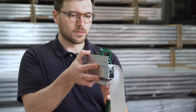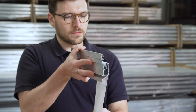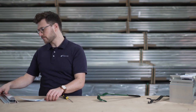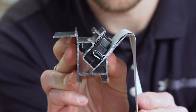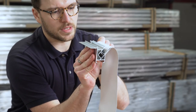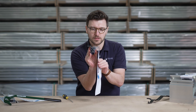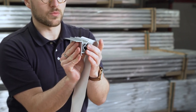You twist to create more tension in the clip. Again, with the way that the clip works, the more tension you create, it doesn't matter — the clip is not coming out. Here's our retro frame with a clip already in there. And as you can see, when the vinyl gets pulled, the clip is being twisted and the teeth engage with the teeth in the channel even more. So that's why we haven't had a single failure in over 30 years of selling the system, because the more tension that is applied, the harder the teeth work for you.